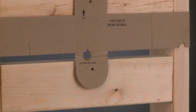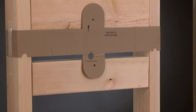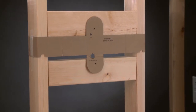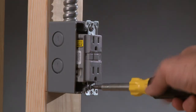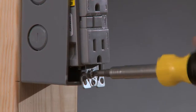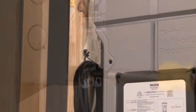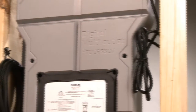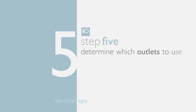If you know where to mount the IO Digital controller, you can install its 2x4 brackets now; if not, get a rough idea of placement until the final decision is made. Step 4: Install the electrical outlet. The IO Digital valve needs to be plugged into a 110-volt AC supply on a GFCI circuit. A certified electrician should install the initial GFCI outlet. The power supply must be installed above the valve with a drip loop between the valve and outlet.